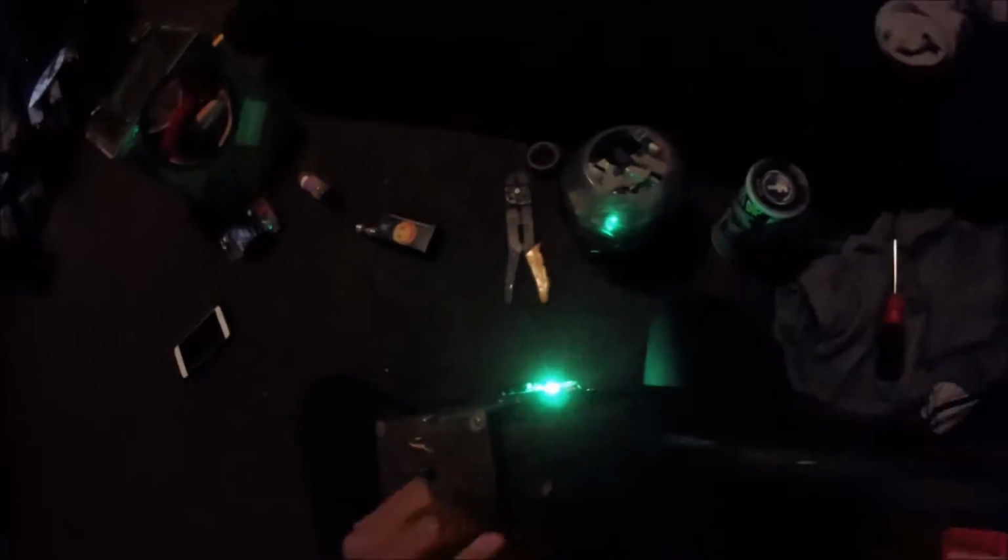And now I'm about to wire up my box and put everything back in it. Another thing I forgot to mention and record: once you've done all your coats and put the E6000 over any little air gaps, what you need to do is take some duct tape, some clear duct tape, doesn't matter what color, and wrap it on the outside of the finished amp. Now, what that will do is prevent any abrasion from taking off the rubber dip and making holes in the rubber dip.